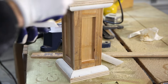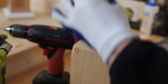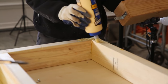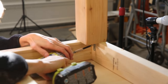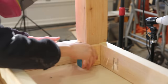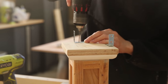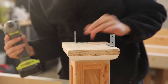Lastly, to finish the column leg I used round-over trim to create an extra decorative effect. The trickiest part of this project is attaching the pedestal legs to the top and bottom shelf. Use brackets to hold them in place with wood glue and clamps, and then add a scrap two by four for extra stability — it also acts as a guide when you screw it down from the other side, giving you extra wood to grab onto.